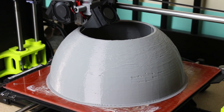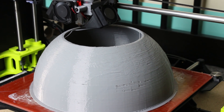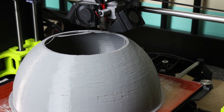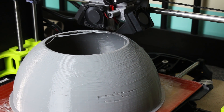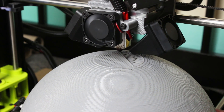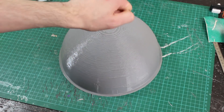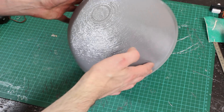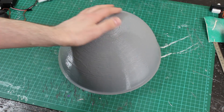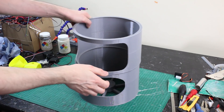Meanwhile, the top of Bender's head is printing on the Moarstruder on the LulzBot TAZ — same as last time — which has a 1.2mm nozzle, so it's fairly crude. All of it's going to get sanded down and filled anyway. You can see a few bits have fallen down inside unfortunately, but there's no support material. It's about 83% of the way through, so we'll see shortly whether it succeeds. It seems to be pretty clean on the outside and it's just bridged over the hole completely. Here's the top of the head — it's extremely tough despite being essentially a single wall with 20% infill, two walls going all the way around. The inside is a bit messy but no one's ever going to see that, and all of this is going to be sanded and filled. I've glued some of these together with normal superglue — they're all PLA prints and they've come together pretty well.